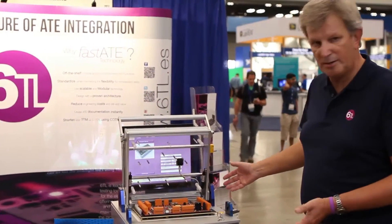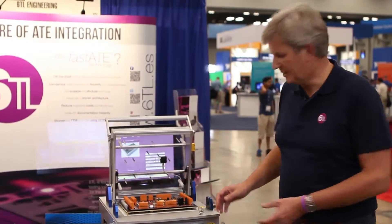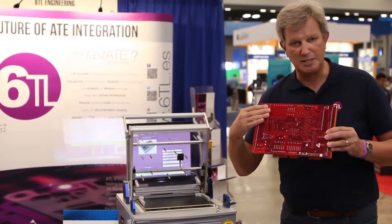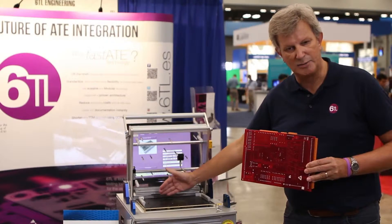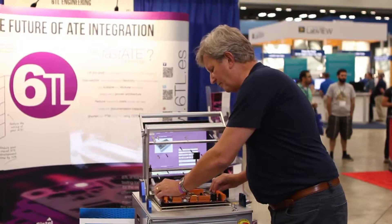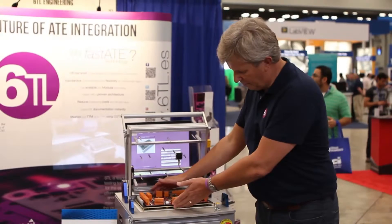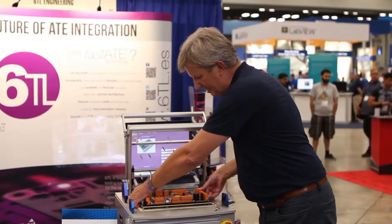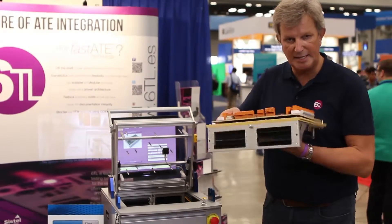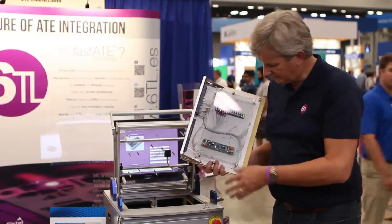One of our solutions you see here — this is the smallest one we have. It's called the 60L08, set up as a base PCB tester in this case. A PCB tester means you need a bed of needles — spring-loaded probes to make the contact between the PCB and the instrumentation, the measurement instrumentation. As you need a test adapter for every PCB that you want to test, you want to keep these parts as low cost as possible. So we created a cassette system that can easily be adapted to your PCB. For every PCB, you get this unique cassette. You have to manufacture this, same with the pusher plate which comes with the cassette.